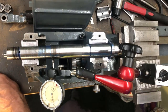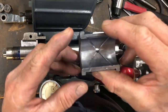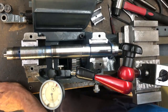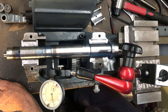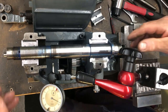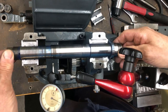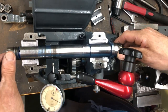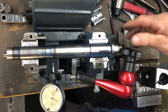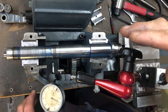I'm now testing the headstock. I have already scraped the bearings somewhat, but I will show what I do from scratch here. The first thing I do is try to set up the spindle — just the spindle floating in the lower half of the bearing set. I've done that, scraped it in beforehand. You have to set it up this way with the two screws in front.